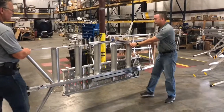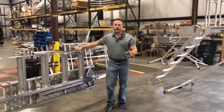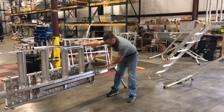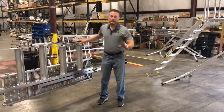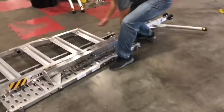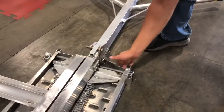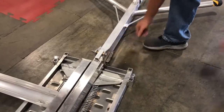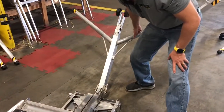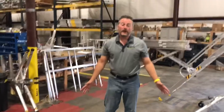Now you'll notice this five-step is close to 11 feet long — that's going to be too long for a lot of elevators. All the models bigger than a three-step come with a hinged leg. This hinged leg allows the leg to fold back in on itself. Something really important about the hinged leg: it has a stainless steel latch. Make sure you don't accidentally break your stainless steel latch. When you're folding the leg back over, hold your latch to make sure it doesn't crimp up and you don't break it. Then just fold your leg over and you can safely carry this wherever you need to.